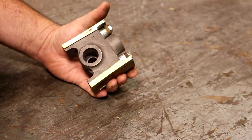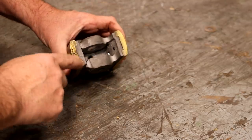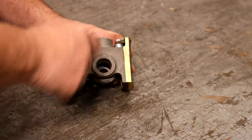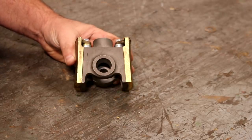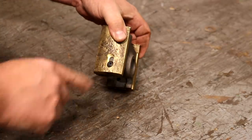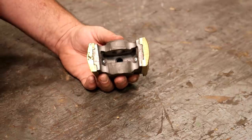Let's go over our part again and where we've gotten to so far. In the previous episode we took the castings and machined a little notch in the bottom where these things slide up and down. This crosshead is designed so these brass shoes are adjustable — as it wears you can remove a shim, and because it's on a slight taper on either side it'll widen out and make this part wider, adjusting for wear. We've got all the machining done for the slot, the screws on the bottom, and the tops drilled. The final step is to turn this to the final diameter.